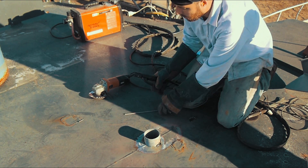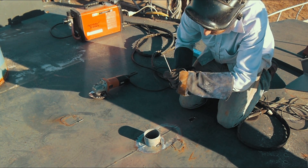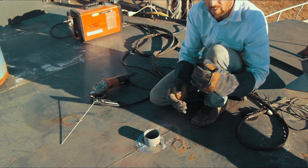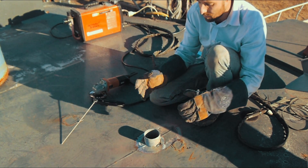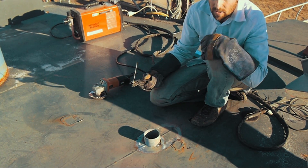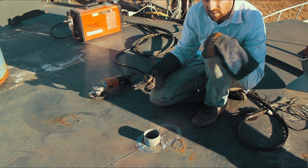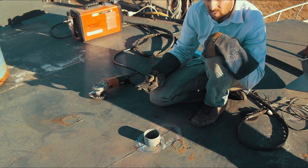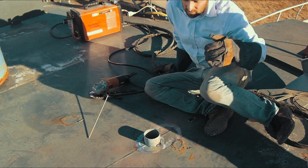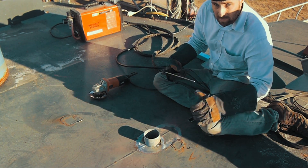Normally all of the welding on this boat is done with MIG. For those that aren't welders: this is arc welding, or stick welding. MIG needs a shield of gas like argon, CO2, or some other inert gas or mixtures — what that does is stop any nitrogen getting into the weld. With arc welding, there's a coating on the steel rod that basically does the same thing. The beauty of arc welding is you can weld when it's quite windy, whereas MIG and TIG welding are quite difficult in the wind. It is quite breezy up on top, which is why I'm using arc welding.